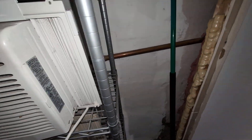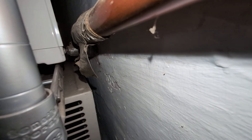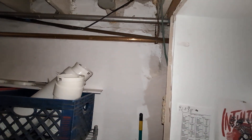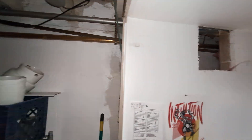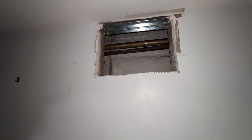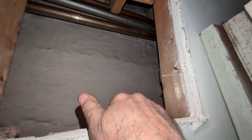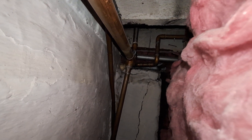This drip is original — definitely was original. There was a steel unit here and someone replaced it with copper, but it was definitely a drip because there's the support peg. There's another one behind the wall. So we've got the drip, and yet we've got a counter-flow main, which is kind of weird, and it did bang. What we did is cut holes in strategic places and double-checked for low spots. We found one, fixed it, and water started pouring down at that end — which meant success. So it was counter-flow all the way to the end, and there's the drip.